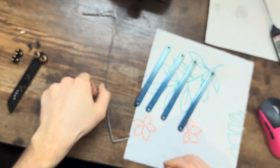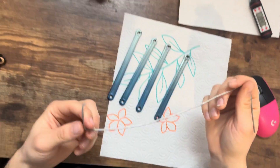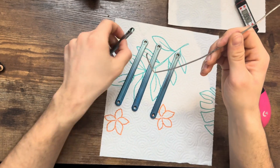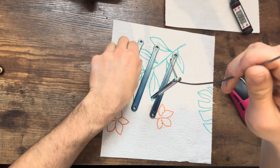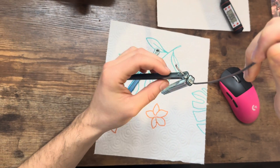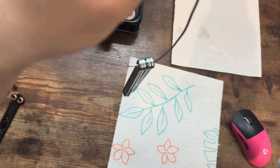I need to get the wire to actually dip these in. What I have here is a titanium wire about two millimeters thick. I just bent it to be able to hang the scales on it like a hook, and we're going to be dipping this into the Titan Edge solution.